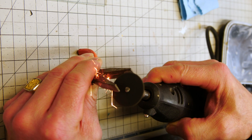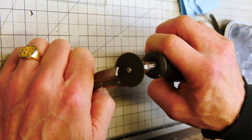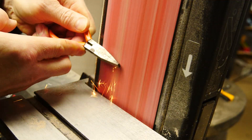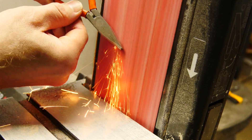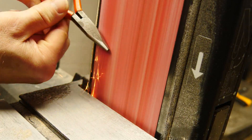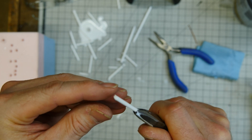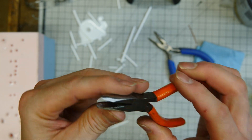The concept is that I'm going to make the inside of these pliers round so they can grip onto the vents. I use a Dremel tool to grind away the flat inside of the pliers, and then I'll smooth out the outside so that they're cylindrical, so I can reach the pliers in around that tube and pull the vents out of the silicone one by one and get a good grip on them. These pliers are now rounded so they can easily grip onto the vents, and then I can twist the part and pull it out — very easy. I should have made these pliers a long, long time ago; it really makes the job much, much easier.